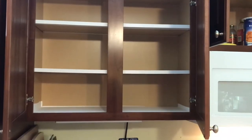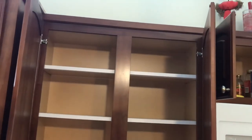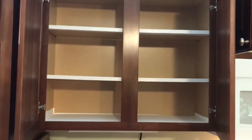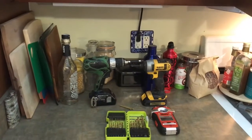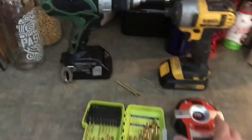Here's a cabinet in this same kitchen where I felt I did not find enough fasteners. There were two up in the top ledger as I just showed, then none in the back wall, and none in the bottom ledger. So what I really want to do is at least get two more in the bottom ledger, and I did — I'll do that using these tools.